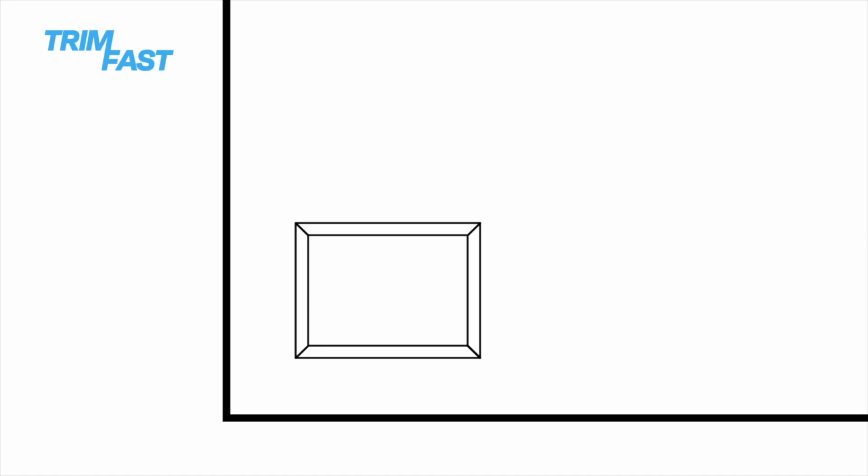We can now begin to install the upper panel frame. Once again, we will need to lightly mark a starting point on the wall with our pencil. Refer to your wall plan and begin your measurements from the top left corner of the lower panel frame. Our wall has an 8-inch gap between the panels and a 9-inch gap from the left edge of the wall. Once you have determined the starting point for the upper frame, repeat the process that we used to install the lower panel frame to install the upper panel frame. With the left panel frames installed, follow the same steps to install the center and right panels.